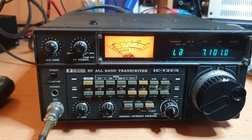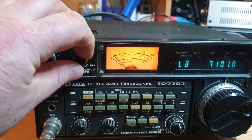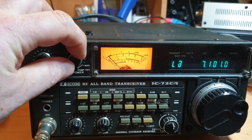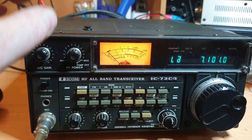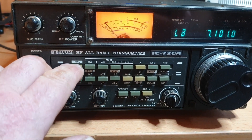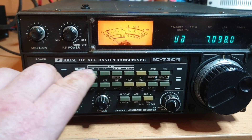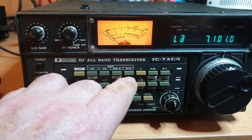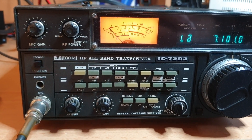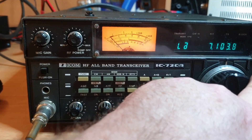Power output for the age of the radio — absolutely fantastic, I'm just really surprised. They were a fairly basic layout — just RF power gain. You could actually dial that back. And from memory, the compression: you could turn compression off, so that would be full power with compression off, or compression on. There were a few other little things you could do: go to CW narrow, reverse sideband, et cetera, with the function switch, and then back to lower sideband, et cetera. So overall, not a lot of controls — the switching is really just for running up on the band a bit faster or slower.